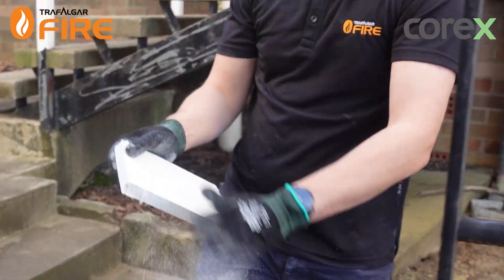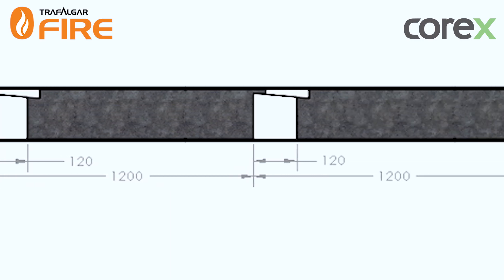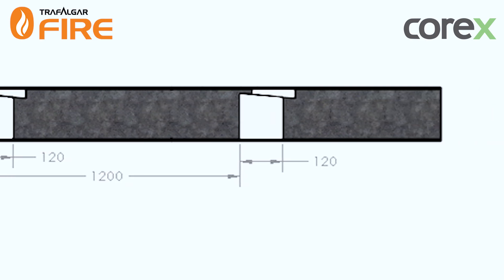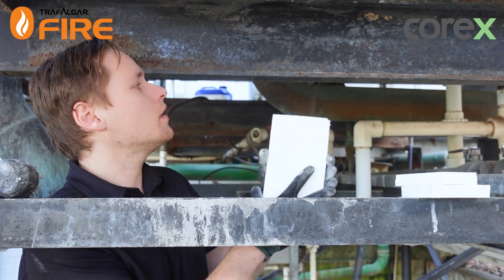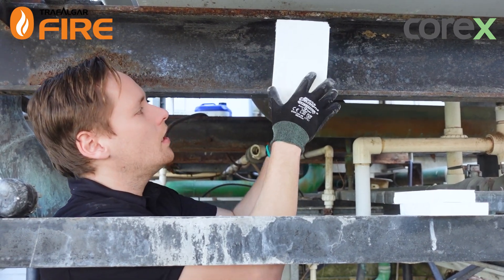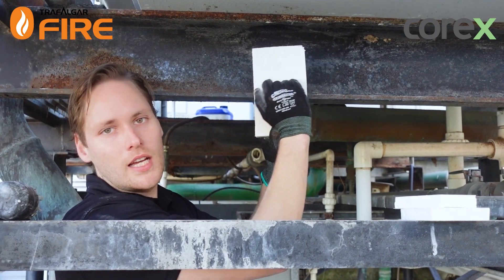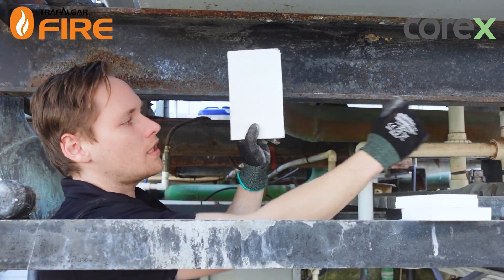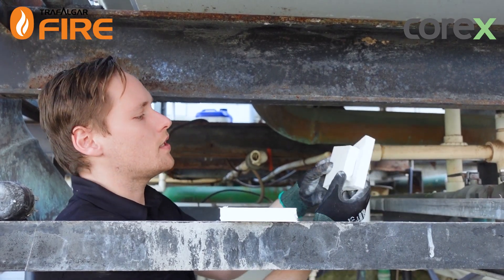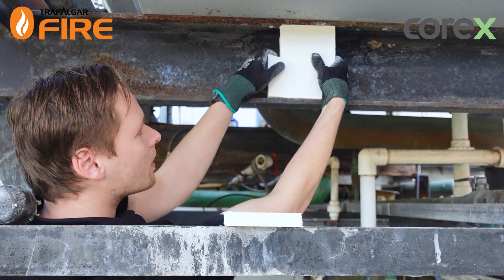You want your noggins and soldiers to be 120mm wide and we're going to install them every 1.2 meters. Now I've got the soldier cut 5mm oversize into the web of the flange. The trick is to then cut across this with an angled cut so we have a tapered joint, which I can then hammer in with a mallet and it'll friction fit in place.